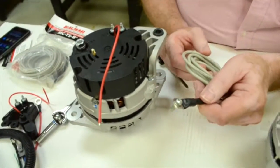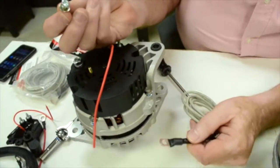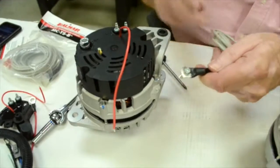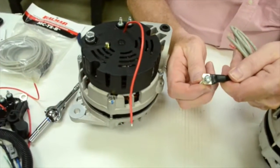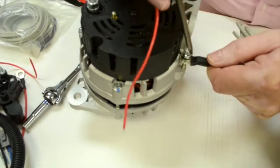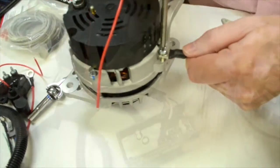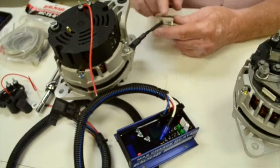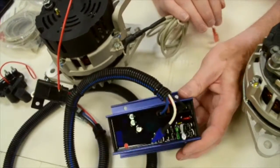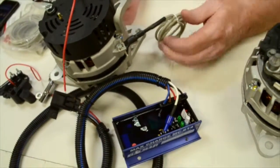This is the alternator temperature sensor. In the temperature sensor, you will find the Phillips head screw and a small washer. You put those together — a small washer underneath the screw between it and the lug for the temperature sensor. There's a hole on the side and you want to screw that in. Once you've screwed in the temperature sensor to the alternator, make sure you connect the other end to terminals number 5 and 6 on your MC614. That should complete your installation.